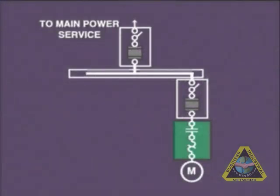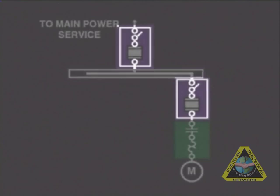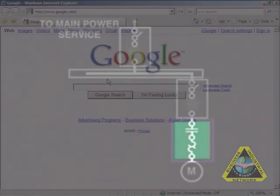What we're going to be concerned with, according to this diagram which relates to Article 430, will be the conductors going to the branch circuit, the disconnect and overcurrent protection, and the necessary overloads for the motor which will be located in the motor starter.